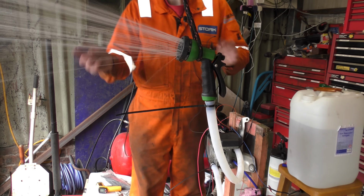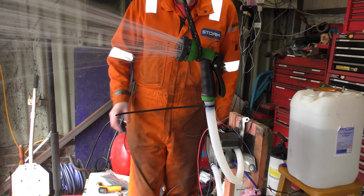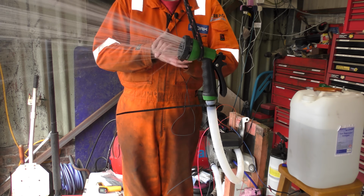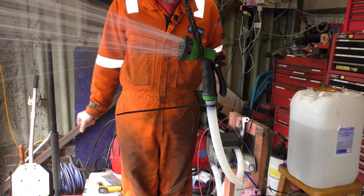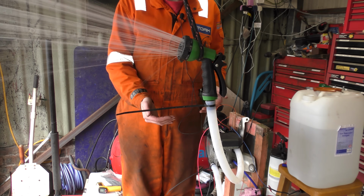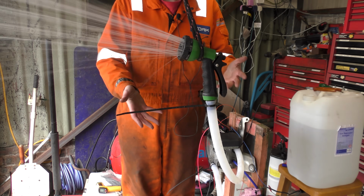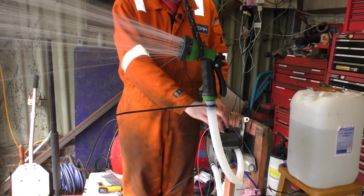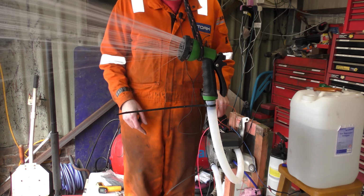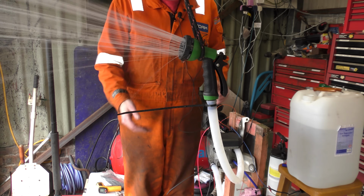It's starting. So now it'll start, run, and then we'll adjust the spray volume to feel it's got a nice shower about it, and you'll see how much actual flow is coming out of it. But I'm actually quite impressed. Obviously it's got maybe half the flow of the bigger heater, but the bigger heater is producing twice as much heat, so it would still do the job. If you can get one of these out of scrappy, 30 quid, Hungarian ECU, or if you're lucky enough to actually get a Webasto ECU that works, Bob's your auntie.